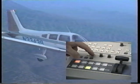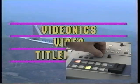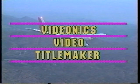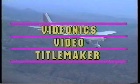Turn on the chroma key section and bring the T-bar down to the B channel. Adjust your hue control for the title maker's shade of blue and adjust the slice control as needed for fine tuning. This process eliminates the need of the MX-50's video output to pass through another video device that could possibly reduce resolution or add unwanted color artifacts.